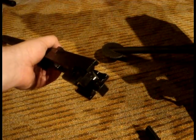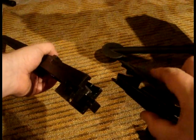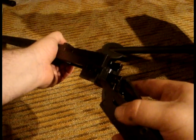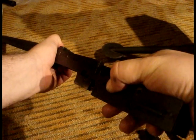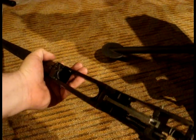Upon reassembly, wrap the accelerator around the plunger arm on the barrel extension. Align the lock frame plunger with the tang on the barrel extension. Align the lock frame ears with the slots on the barrel extension and push firmly together. All 3 elements must be aligned for lockup.